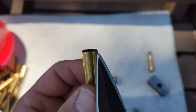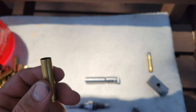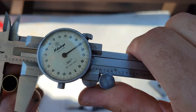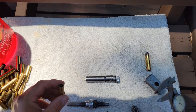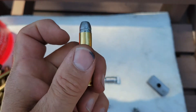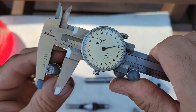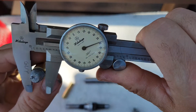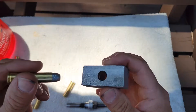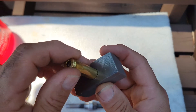It's got a very slight radius and the diameter at the mouth is too small — the inside diameter is too small. This is what our loaded round is going to look like; it's just a dummy to set the dies. I need to get this outside diameter up closer to 0.458 or so. Our maximum based on the reamer I made is 0.461, so that's a good fit, and it stops on that shoulder just inside of there.